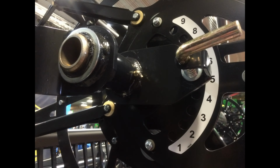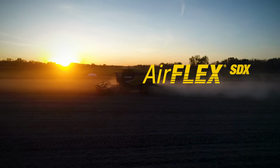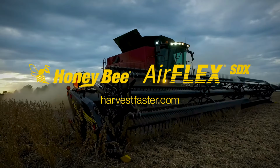There is a grease point at each end of the reel which should be lubricated 1 to 2 shots of grease every 10 hours. There is a quick overview of the reel on a Honeybee Airflex. If you have any further questions, please refer to your operator's manual or contact your local Honeybee dealer.